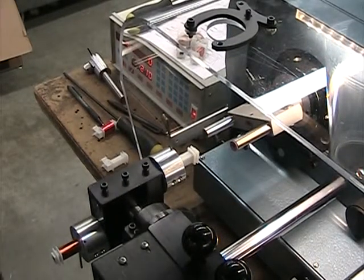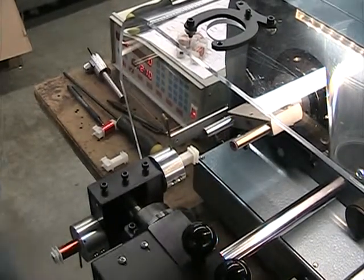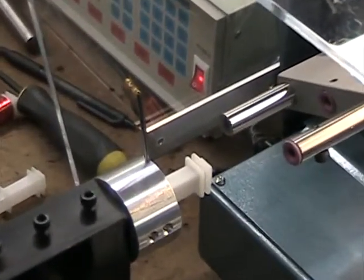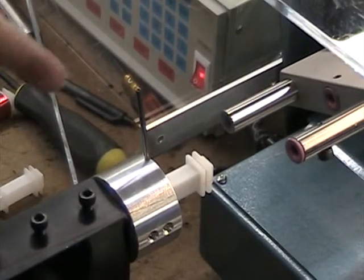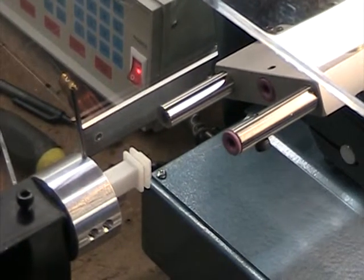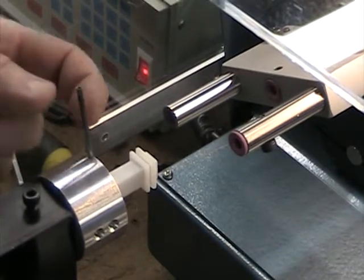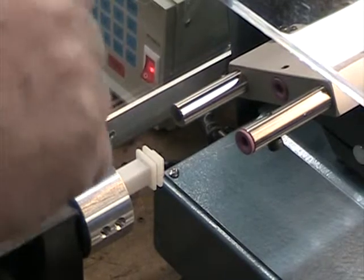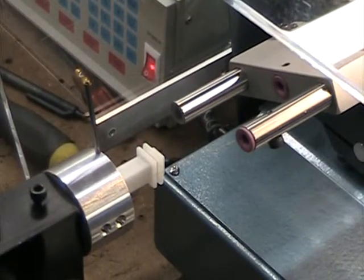I will be winding 2500 turns of 35 gauge wire and I'm going to demonstrate how the turret works. While one coil is winding and rotating, you can be loading another coil. Part of this is also to demonstrate how this roll pin will bring it down right near a slot, so the inner wire will have to come out of a slot.